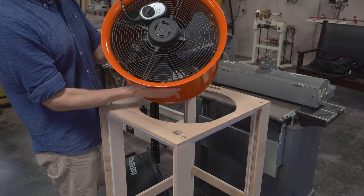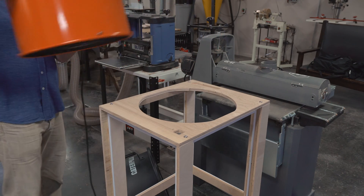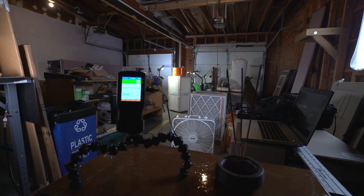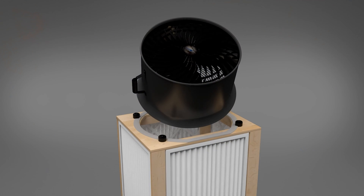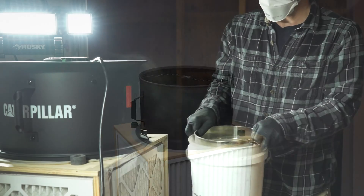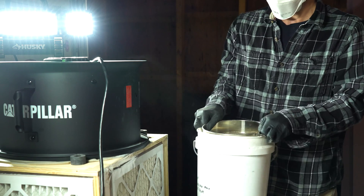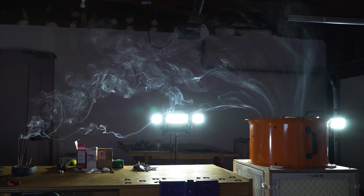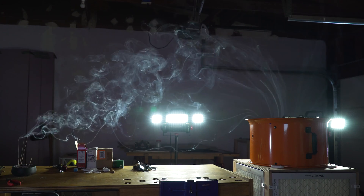This particular fan is not an ideal option for blowing into the filter box because the motor is not enclosed and dust can get inside of it. A quick side note on these configurations: if you want the most efficient way to filter the ambient air in your space, point the fan upwards. This option will effectively clean the air far away from the filter. However, if you want to cut down on dust emitted from a specific source, point the fan downward into the box. This may seem irregular, but it works incredibly well at capturing airborne dust from up to about 5 feet away.